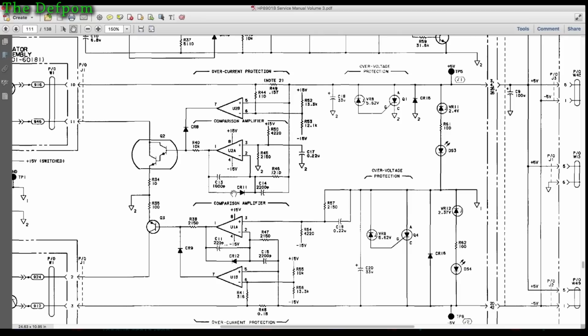It's got some feedback through that diode, so that's going to be dropping it down a little bit anyway. I don't know what it's doing. It's obviously filtering those caps, smoothing as well. So yeah, so it's comparing those two pins, and then it's outputting what's required in order to get the right voltage coming out. And the same on the negative side, it's got filtering caps in there, reverse diode that side, you know, so that's the negative rail, so it's got negative passing through.